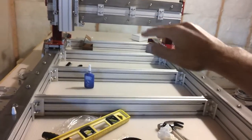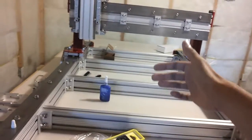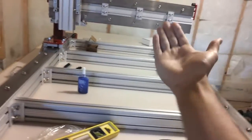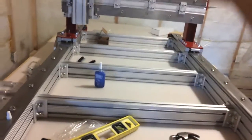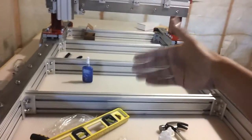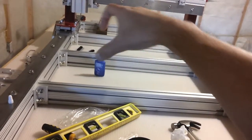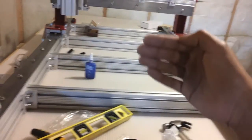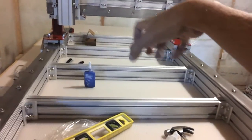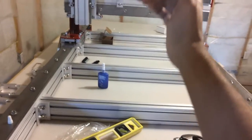If the water is flowing backwards, it's going to carry the cuttings and chippings back, and they'll fall over into a giant tray. That tray is tilted forward at the bottom of this machine. The tray will have little shallow walls, like inserts, so that when the chips fall, the water has something to obstruct it, and the chips have a place to hang on to. So the tray will be tipped forward, so that the cuttings and chippings are falling back.